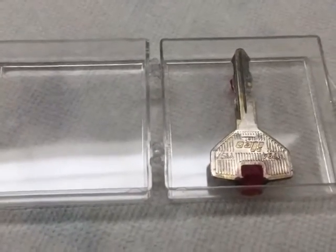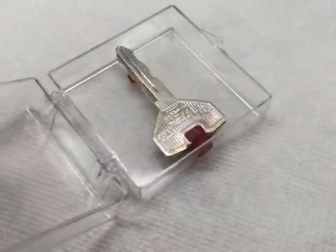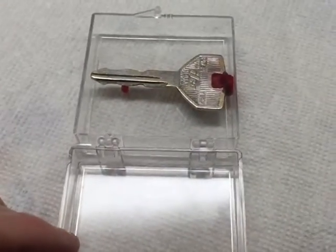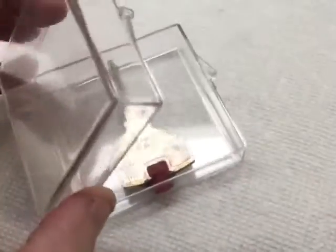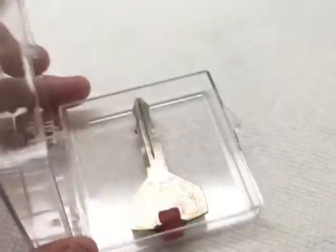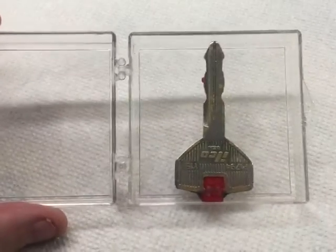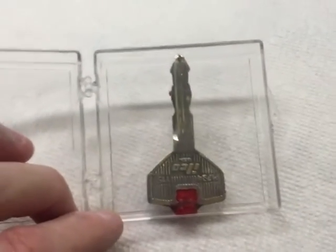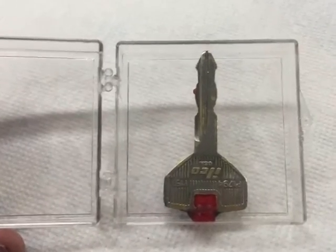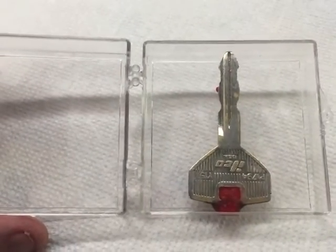This is a spare key that I've been needing. I'm going to make a two-part mold, and I will be wax injecting into this mold. I'm using an acrylic hinged box here. I'm not sure of the size, but I'm sure you guys have all seen these boxes - quite available, and I think they make really good mold boxes. I could do this with a single open pour mold, but I would have to tear the mold up to get the key out. So I'm going to take a little extra time and make a two-part mold, in case I want to refer back to it.